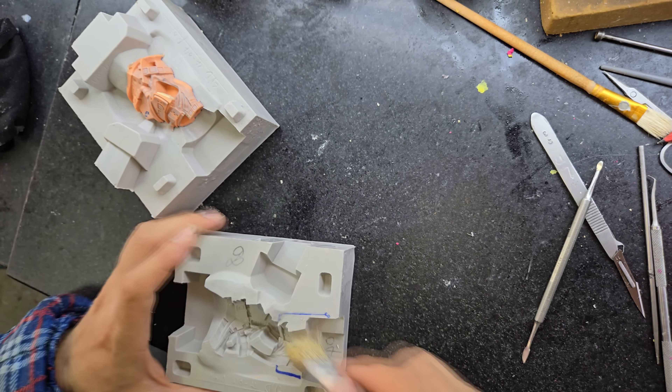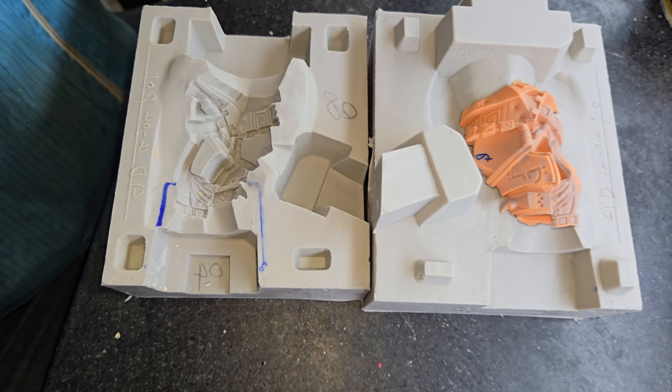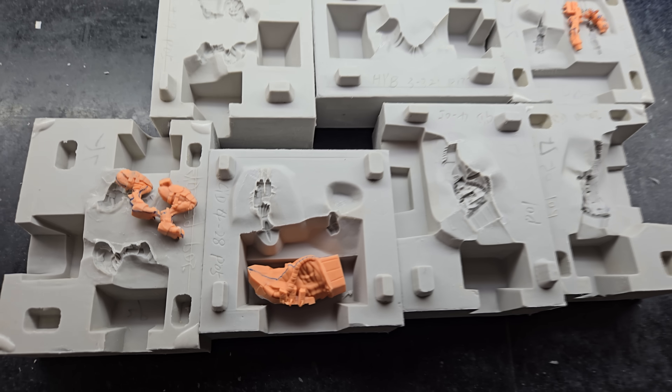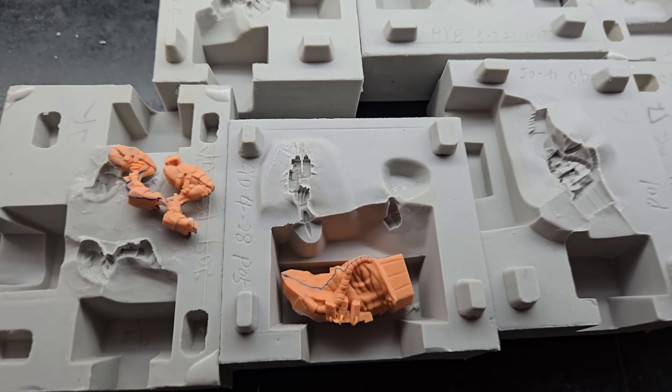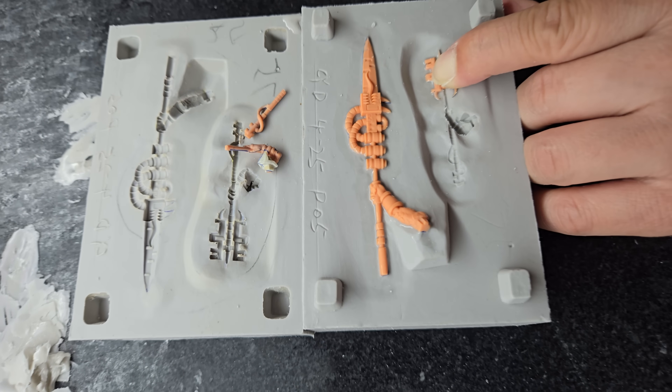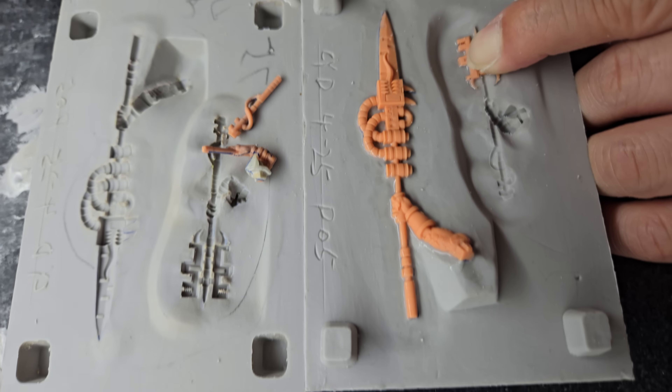Next, a complement of this new silicone block can be taken until every part of the mold has been remade in this hard gray silicone. These silicone blocks are the proper shapes for the final molds, but they aren't made of metal — we're still two steps away. These silicone blocks are going to be used as masters in their own right to make investment molds out of ceramic, and then it'll be time to cast metal.